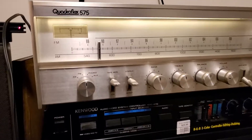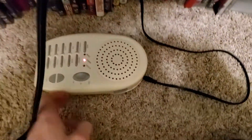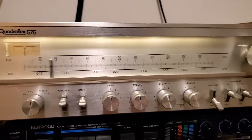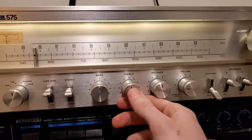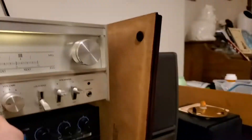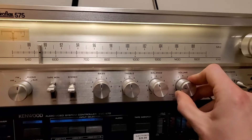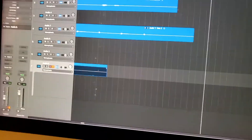So right now we're on the phonograph input. I don't have a phonograph hooked up — I have this sound machine. But phonograph works. Obviously not the right level of input, and this is not a stereo signal. Nice clean pot. Let's get a stereo recording on, and then we can check the mono/stereo switch and make sure that's working. But this is the aux.